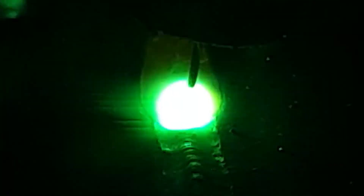As you can see, we've got a smooth transition all throughout the joint when we're capping. We turned our volts up to 19 volts for the capping run and we turned our wire speed up to 5.5 metres per minute.